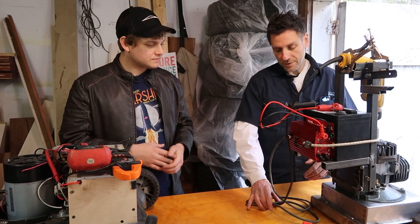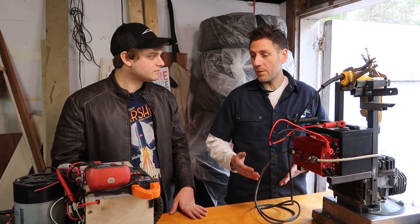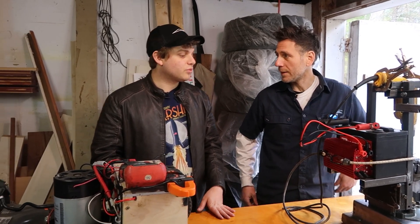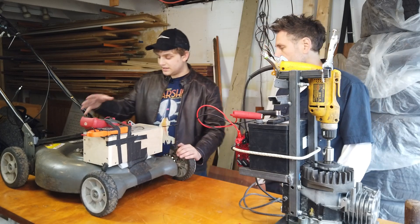What was nice about this is that we got to measure the watts. We put the kilowatt meter on there, and once we knew how many watts, we could size the battery appropriately. We had an idea of how many watts we'd be drawing.